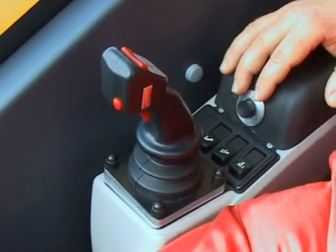Right hand control console: right joystick, dead man switch, horn button. Rocker switch for high speed hoist, or for steering with released parking brake, or all wheel steering of axle 1 if unlocked with released parking brake. Hoist drum rotation indicator. Function on/off rocker switches for main hoist, derricking, telescope. Button for console angle adjustment.